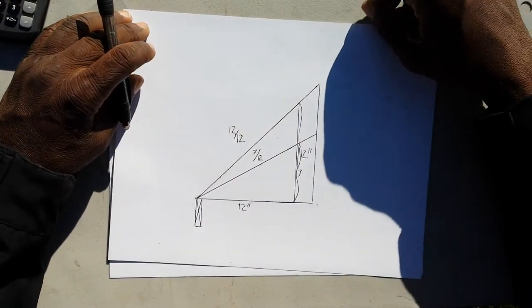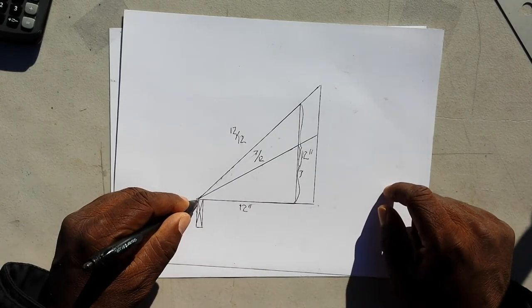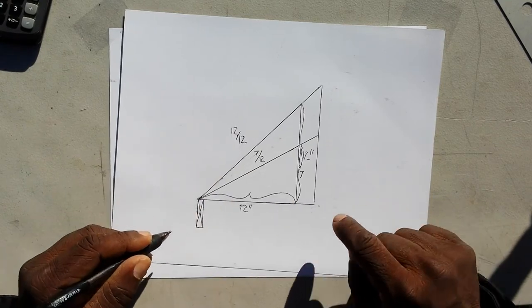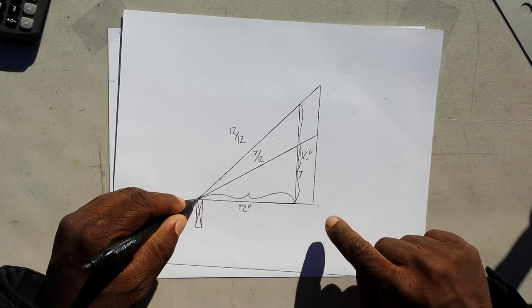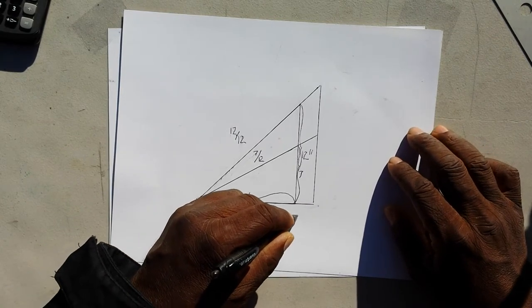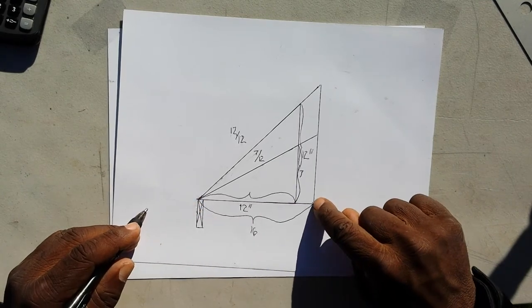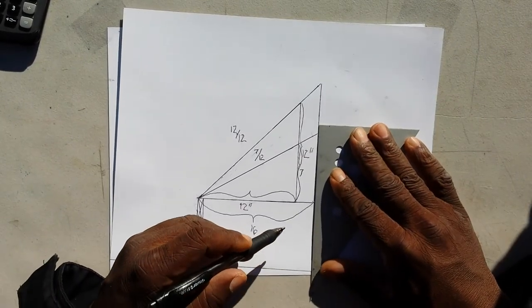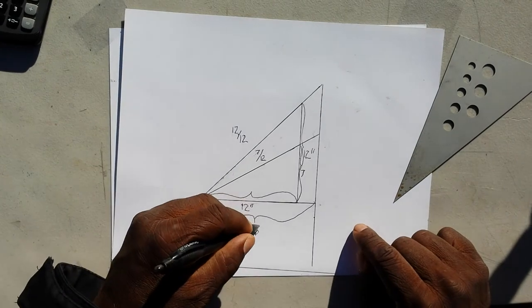See that? So now from here to here, yes, that's 12 inches. Okay, so we're going to draw a little bracket. That's 12 inches. Okay, the arrow is pointing the other way, but you get the point. But from here to here is 16 inches. So this is 16 inches from the outside all the way to the building line, okay? And the building line would run all the way down. That's the overhang. That's the building line. So you got 16 inches here, all right?